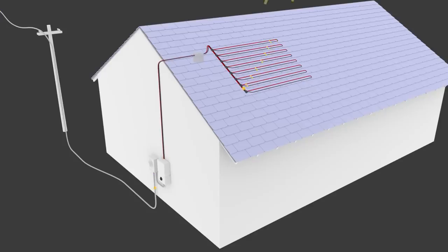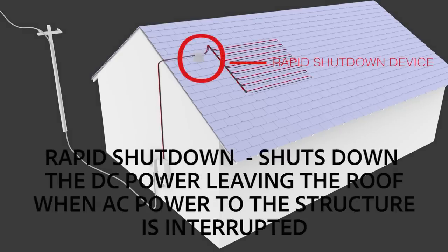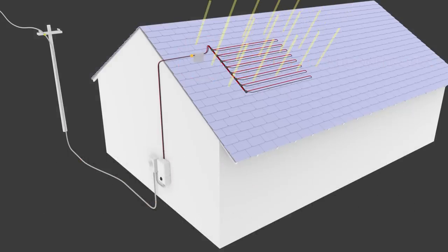Typically, only about 16 volts is present in each branch. Although the diode trunk harness operates at a much higher voltage, all of the testing conducted indicated that there is almost zero risk of shock or electrocution when cutting or crushing the tiles or when cutting the diode trunk harness. This is in part because the system is not earth-grounded anywhere on the roof. The Tesla solar roof is also equipped with a rapid shutdown device, located in close proximity to the solar array, which serves to disconnect the circuit leaving the roof and traveling to the system's inverter.